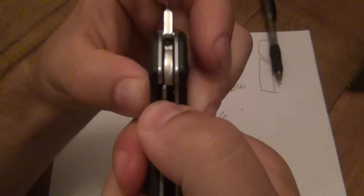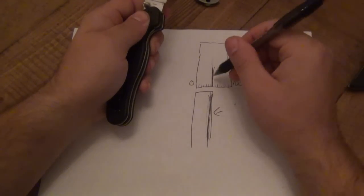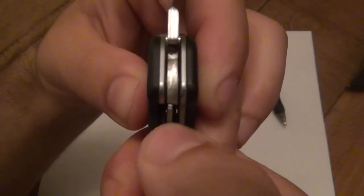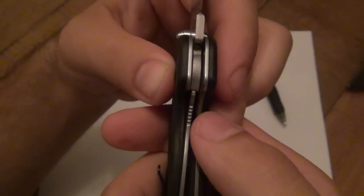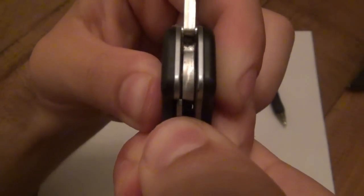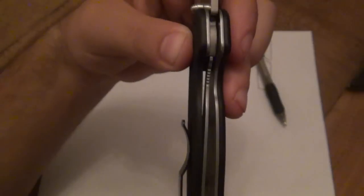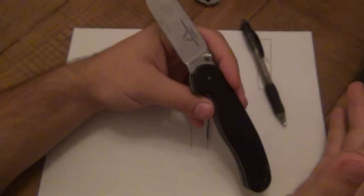The early and late terminology: imagine your 50 percent line right in the middle. If the lockup is before that, it's an early lockup — which is considered a good thing, meaning you have plenty of time for it to wear across. Late lockup is when it's to the right of that line. This is of course perception and opinion — someone may say that even a 40% lockup is late if they feel it should barely be touching. Generally the more to the left, the earlier the lockup.